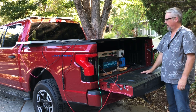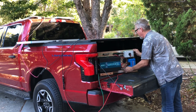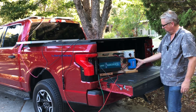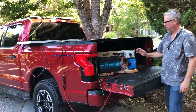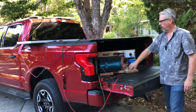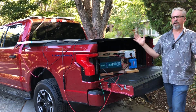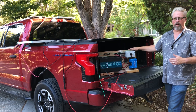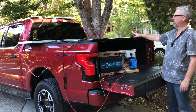So what did I find out? I think the design for my solar charging system is pretty sound. The way I have it set up turns out to be not ideal though, because when the inverter heats up the exhaust fans blow onto the controller unit, which tends to make it hotter. But I temperature-checked them throughout the day and they were up to 100, 108 — something like that — but they didn't get extremely hot. The inverter would come on and then go off again, but of course I was only running 7 or 8 amps through it. It will be a different story if I have a whole array producing like 2000 watts.